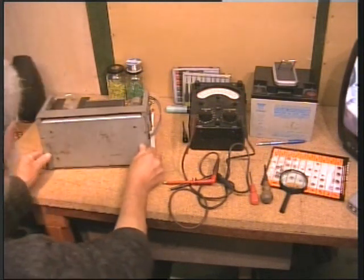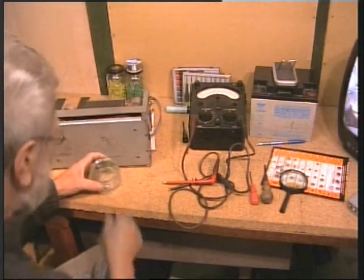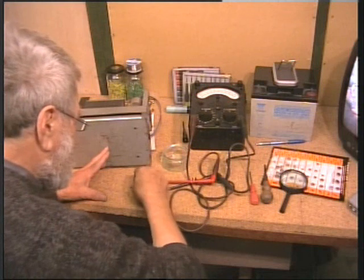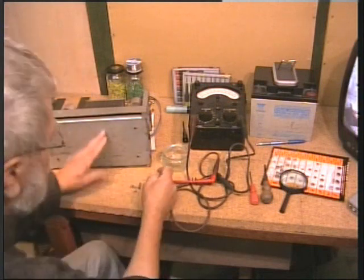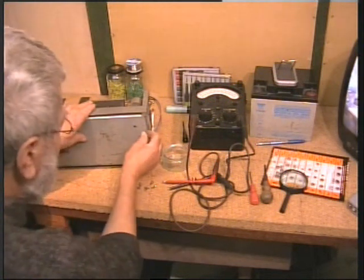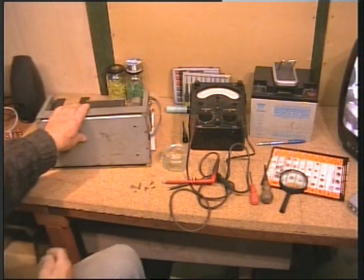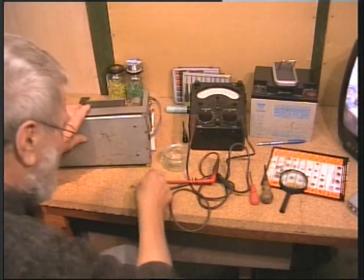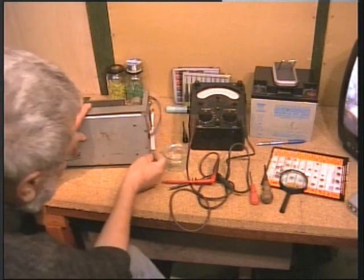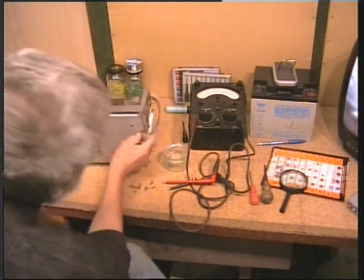Okay, he says, my radio doesn't work. He says, I've had a look, and immediately your heart sinks, you know. And he says, I found six or seven screws that were loose. I've tightened them all up, but it still doesn't work. What screws have you tightened up? What bolts were loose? And it turns out he'd gone in every IF can and he'd screwed the dust iron cores down at the bottom of these cans, and of course he broke every single one, and so the set had to be realigned. Then we had to find out what he did. Oh dear, it'd be better if he'd left it alone.